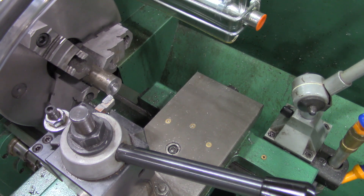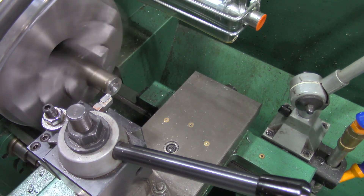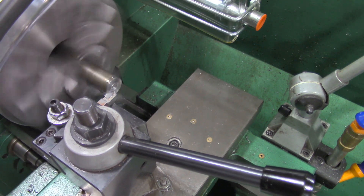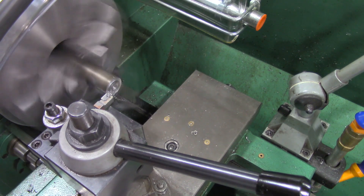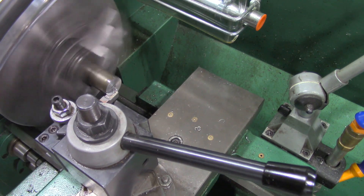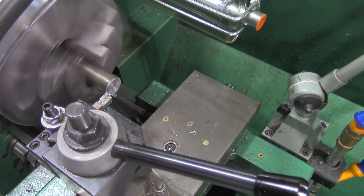The first operation is to clean up the end of the shaft. We've got our cutter here — we already demonstrated this facing operation, so let's get into it. Just going to get it close and clean up that end so we get a nice squared-up face all the way across. Still got a little bit of a divot there, so we're going to keep going until we get rid of it. Almost got it cleaned up — still a little bit of a divot. Take one more cut and we should get her cleaned up.